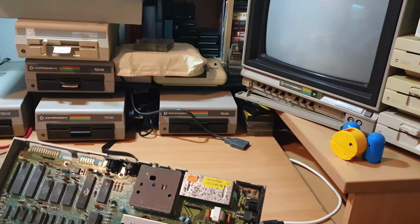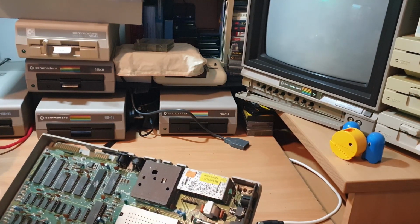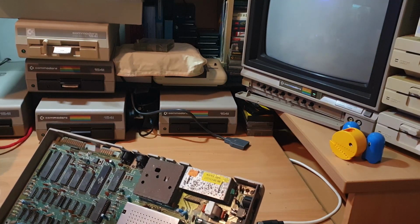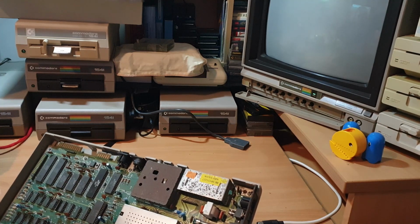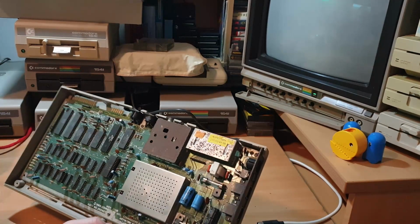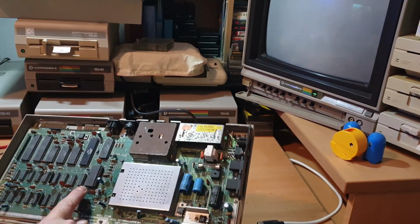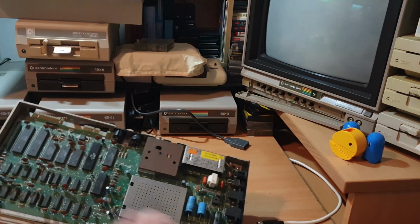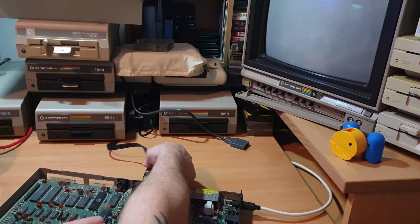So that's got keyboard removed now. Again, just like the other one, it's the same thing. This one's the same 407 motherboard, Rev C, or am I mistaken? No, yeah, we're a Rev C in the other one. That's good. We've got an identical board with even less chips socketed. So on this board we've only got one chip that's socketed, and that's the SID. I'm just going to plug this in now and just see what it does. I know the keyboard's off it now, but it makes no difference to be fair with the keyboards in or out.